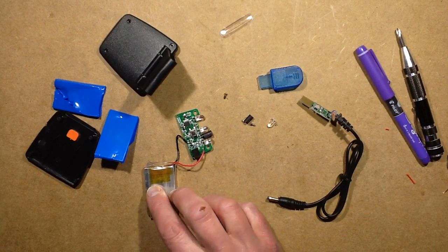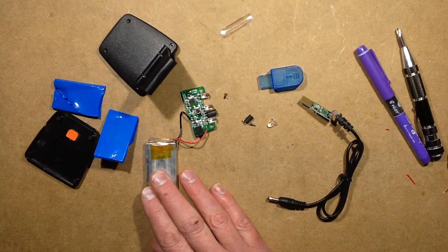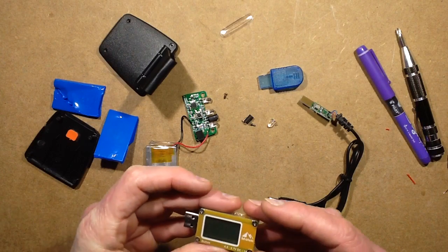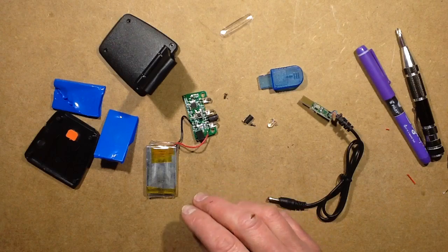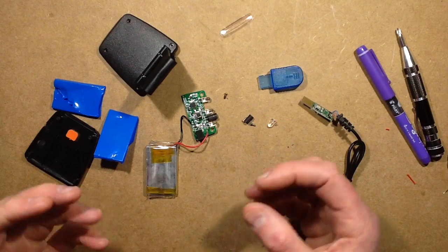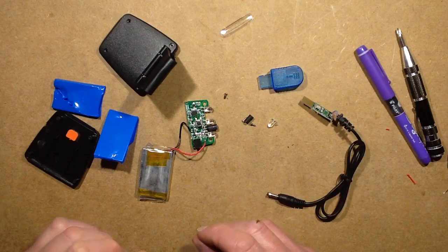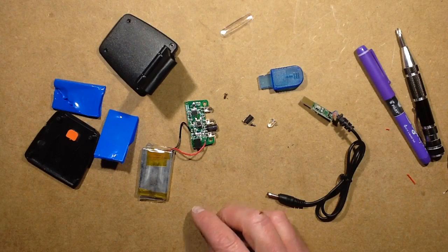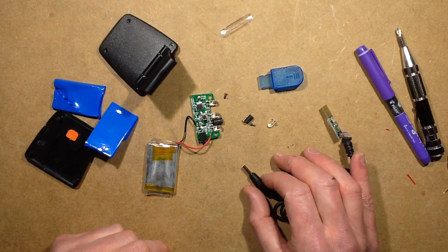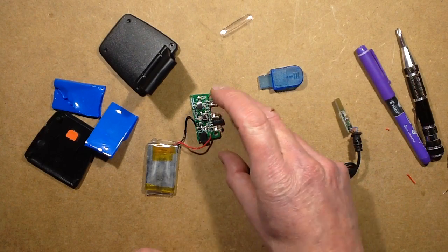I'm not sure what the capacity of this cell is — maybe 500mAh, or pushing it somewhere between 500mAh and 1Ah. I'll have to do a test using the MATEC analyzer and run it down. Running at 60mA with a rough value of 600mAh, you're going to get about 10 hours continuous on a full charge, and it's only going to take about 3 to 4 hours to fully charge back up from a USB power supply.